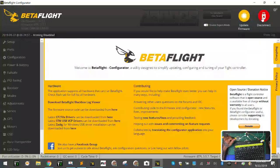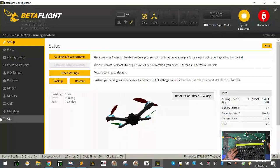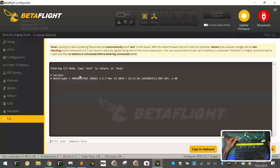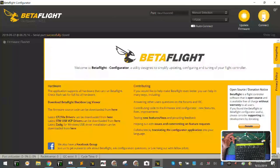So we're gonna connect, and we're gonna go to our CLI, and we're gonna type in the word version. Make sure that we're running our OmniBus version. So in this case, I took it to 3.5.7. We can go higher than that, and we will most likely, but I just wanted to see 3.5.7, where it was at, where it may have come out of the box like that. All right, so in this case, how you're gonna set this up is we're gonna disconnect here and then we're gonna reconnect.